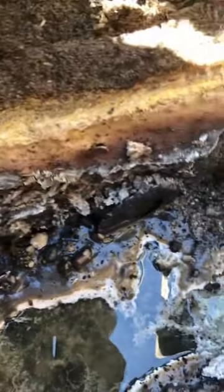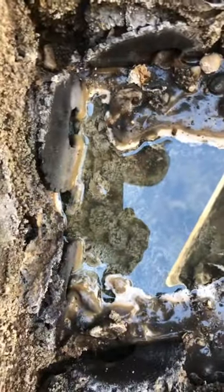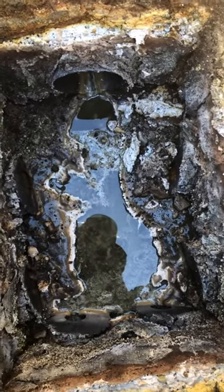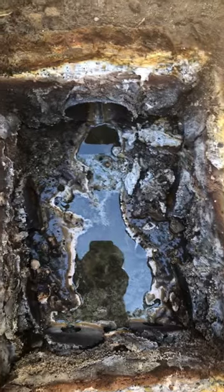These two here — nothing is going down those other laterals anymore. This waterway is making a short-circuited path directly to just those two, and that's why we see effluent down below in the field. We're going to correct this — clean it up — and we'll have water flow to the rest of the laterals to get this field back in shape.